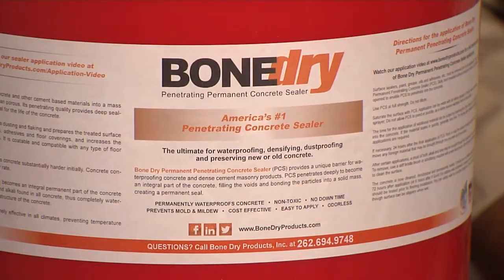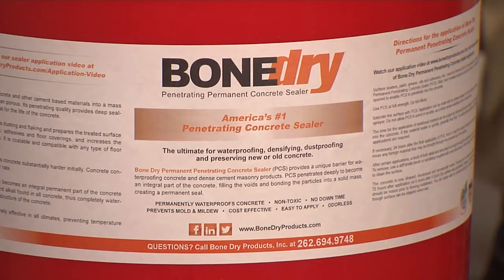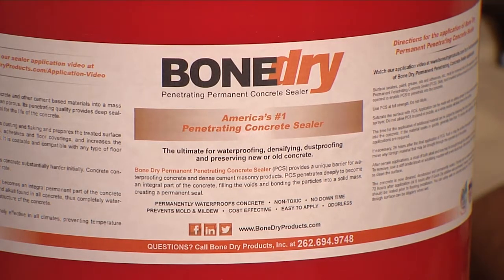but silicates are much better. So Ed, my answer to you starts with, it's a good thing to be a friend of Lou Manfredini's, because a friend of mine owns this company, Bone Dry Products, and they make the best concrete sealer that you've never heard about. It's a commercial-based sealer that's silica-based, as you mentioned. The whole idea behind these types of sealers is they bond with the chemicals that are inside the concrete.